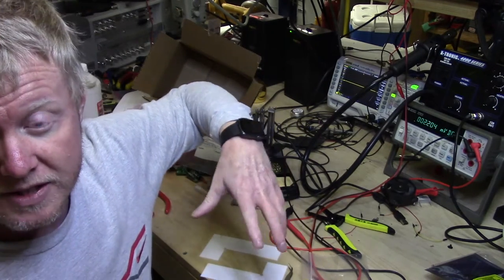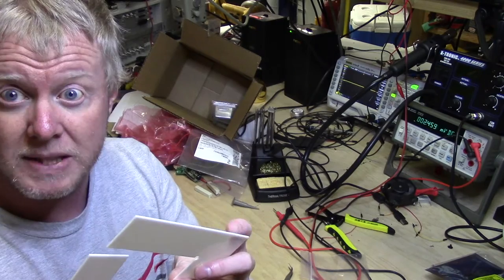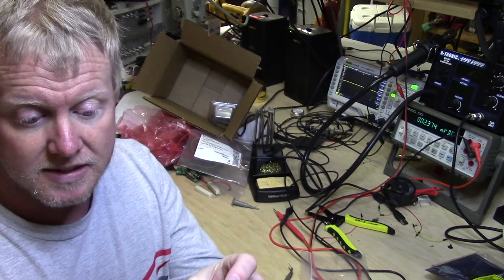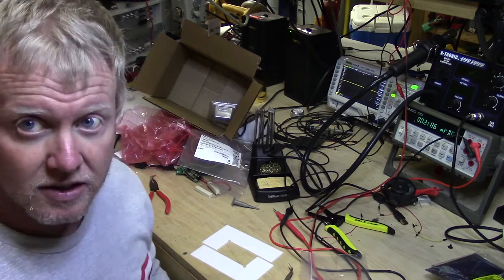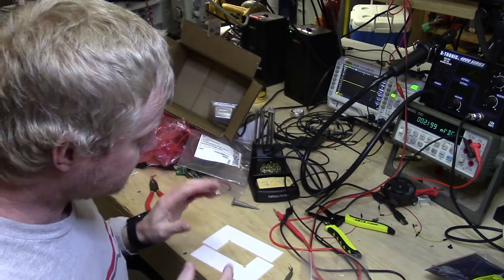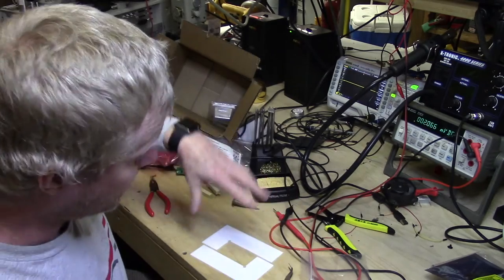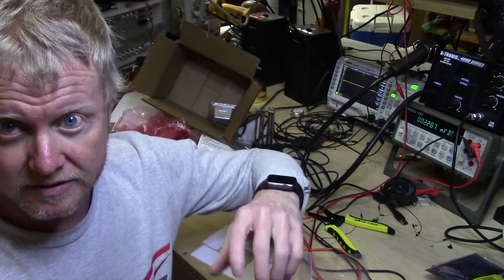If this was a more complex board, obviously we'd have to do something different. I have a similar set of this that's mounted on a PCB that has a hole cut, and that's what keeps the board up off the table on more of my complex double-sided designs. So it's one thing to keep in mind when you're doing both sides of a board: to do the stenciling on the other side, you're going to have to lift that board up somehow and keep a nice plane. For simple boards, I recommend just putting two fingers on the edge of the board, holding the stencil and working your way through the apertures. On a more complex board, that's not possible, and you're going to have to actually mount that board and get it stable, flat and level.